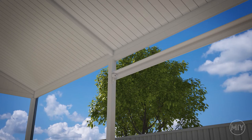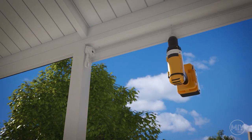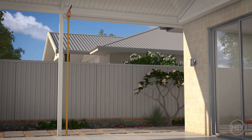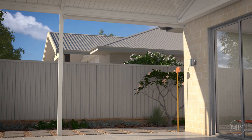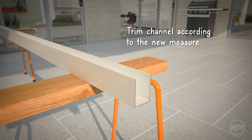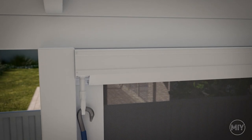If you have ordered a hood box — hood boxes come in two sections. Section one will already have the side brackets attached for you. This part of the hood box can be mounted to the bottom side of the existing patio beam or through the side brackets as demonstrated in this video. Once section one of the hood box is installed, measure from the ground to 3mm from the underside of the hood box — this allows for section two to fit in easily. Use the measurements to trim channels to size, then continue as per the standard install. Now that your blinds have been inserted and setting points have been drilled, finish off by clipping section two of the hood box into section one, then fix the sides to brackets using a wafer head screw as shown.